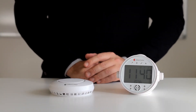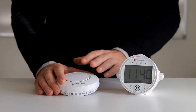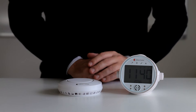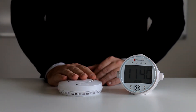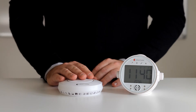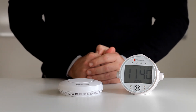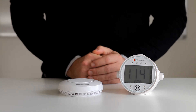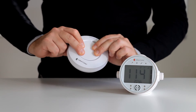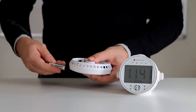In case you have a very small system containing smoke alarms only and a number of receivers, we still need to be able to change the radio key even though it doesn't carry any DIP switches, and we also don't have any other transmitters around with DIP switches. In order to change the radio key then, we need to take out the batteries, reinsert the batteries, and go into a change radio key mode. From that mode we toggle from radio key 0, 1, 2, 3, etc., up to radio key number 9, and after that it will reset back to 0. So let's try that out. We remove a battery and we wait for 30 seconds, or discharge manually by holding down the test button. The click sound indicates that it's ready to receive a new radio key.